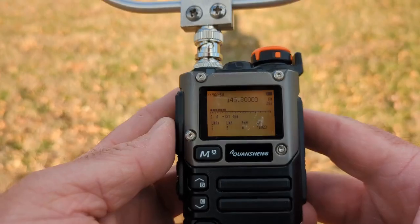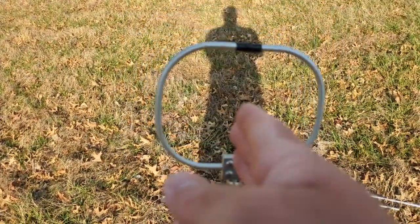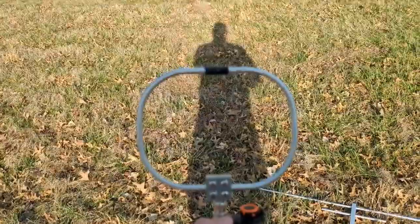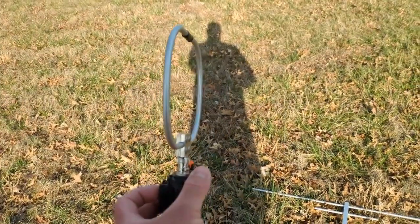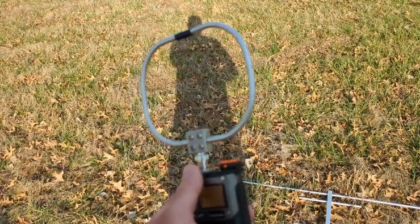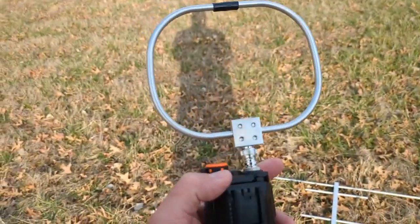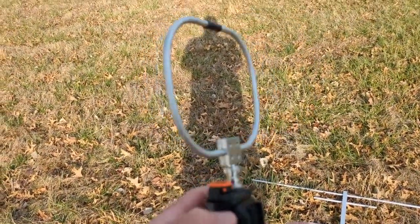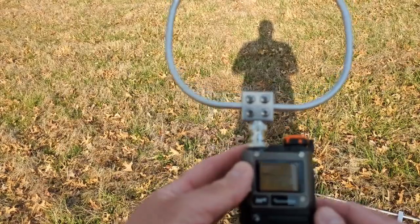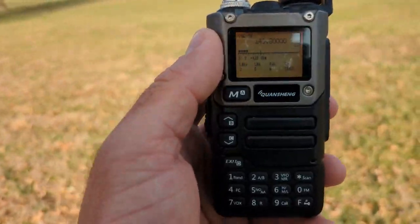The way the loop antenna works is kind of the opposite of the Yagi. Instead of looking for the strongest signal, I'm going to look for the weakest signal. In the plane of this loop there are two nulls where it will not receive a signal — as it's directly pointing at the source, the signal would go away, then come back as I turn, and go away again at 180 degrees opposite. So I can get an azimuth by turning around and looking for when my signal disappears. But I don't know if it's the azimuth to my signal or the back azimuth — I have no way of knowing until I take more than one measurement.